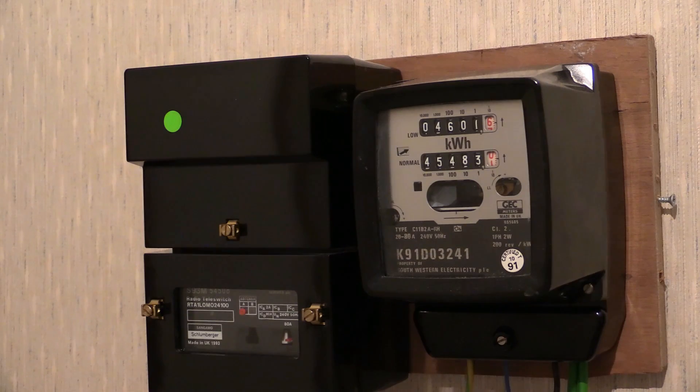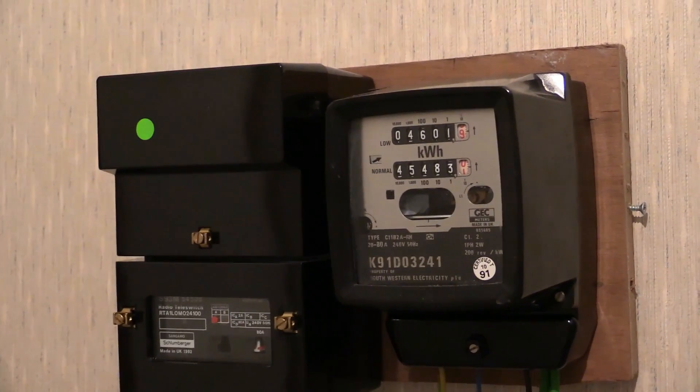But because this is random loading, I could leave that going like that all night until that radio tele-switch turns back off at half past seven tomorrow morning. But like I say, I won't do that because it is a fire risk, exposed live connections, and also I'm pumping 75 amps through that electric meter. The electric meter would take it, but my two little transformers are 30 amps each - two 30s is 60, but I'm actually tugging 75 - so they're overloaded by about seven and a half amps each, which isn't good for them. They'll do it for the duration of this video, but anything more than that they're going to start getting hot and cooking. If I popped them, I don't think Mr. Photon would be too happy with me, because he donated those in the name of science so that we could do videos like this.